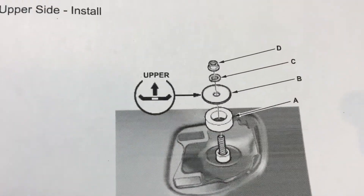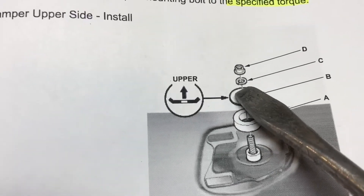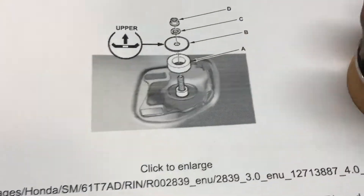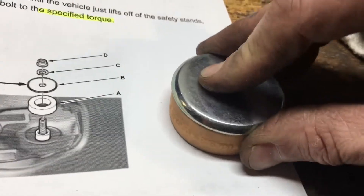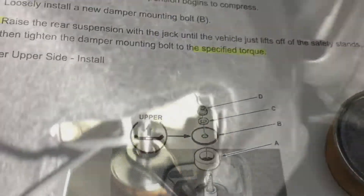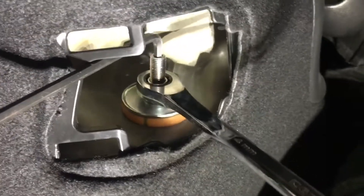One important item I should have pointed out — it's kind of counter-intuitive. Make sure the damper washer, the one below the nut and the spring washer, is oriented in this manner. It's counter-intuitive, but I kept the stack from the factory — this is how it sits. The manual specifically calls out this orientation. There's very little run-on torque here, so the allen key will comfortably sit there. You can keep your crow's foot at 90 degrees from the wrench itself — there is no calculation required, the correction factor is zero.